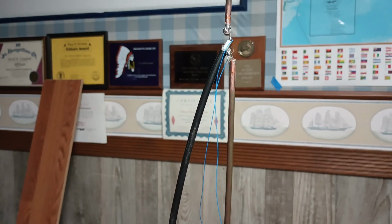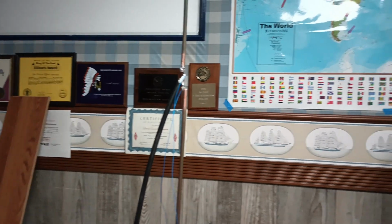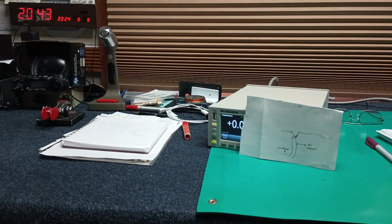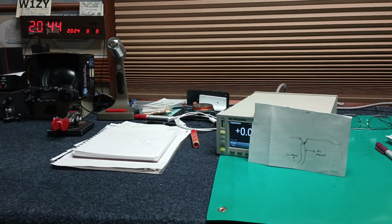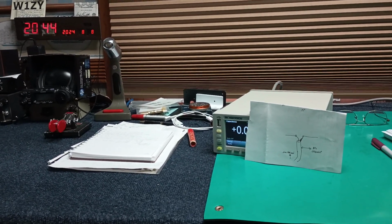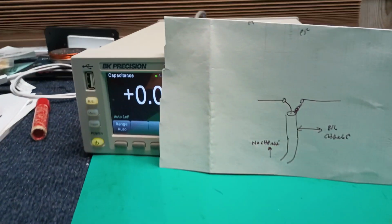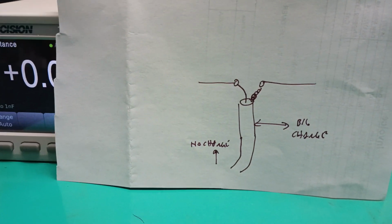But when I tested just about a 1/4 inch spacing between two number 6 wires, I couldn't measure the capacitance. Could not measure it. It was more indicating charge from the ceiling than anything else. I calculated that between 2 number 6 wires, 0.2 inch in diameter, it calculates to 0.03 picofarad. That is precious little capacitance between the wires to couple anything, but it doesn't take much.